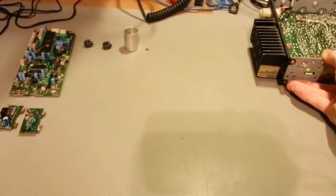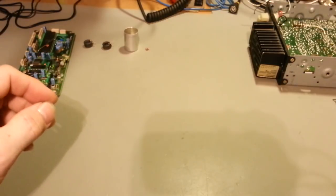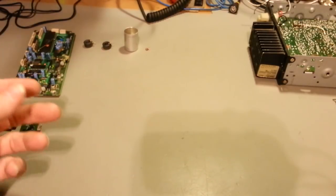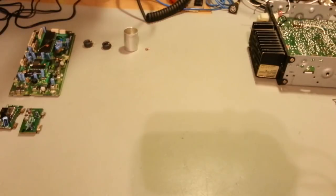All of the coupling transformers in the RF amplifier circuit are toroid style on a ferrite core, and they pour that glue all over them. It eats and strips the enamel coating off the magnet wire where they soldered the leads, so the glue touches unprotected wire and eventually shorts out the windings. Once leads are gone, integrated circuits, resistors, capacitors, toroid transformers — it just wreaks havoc inside a radio.